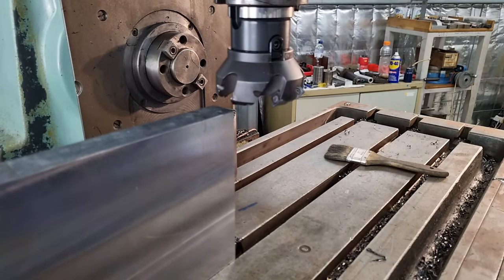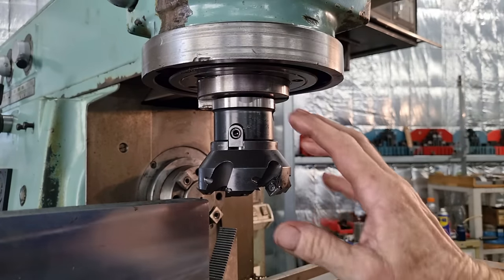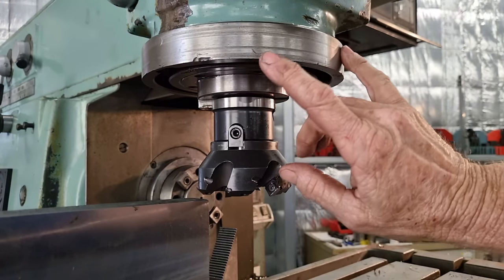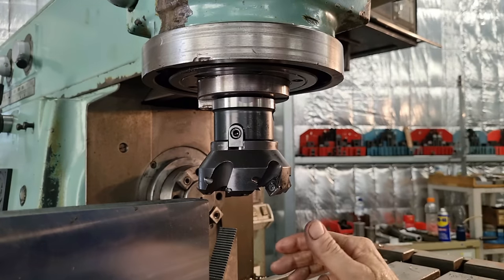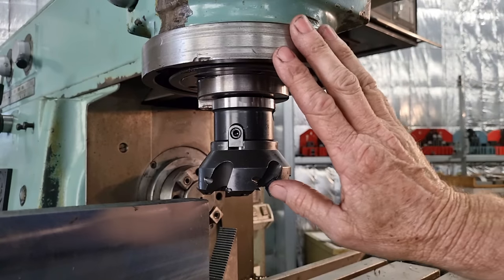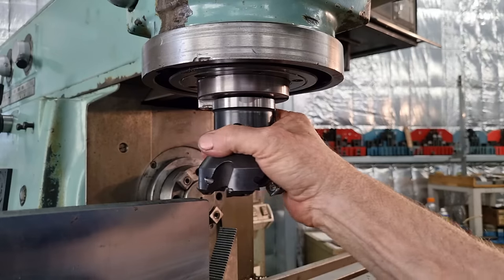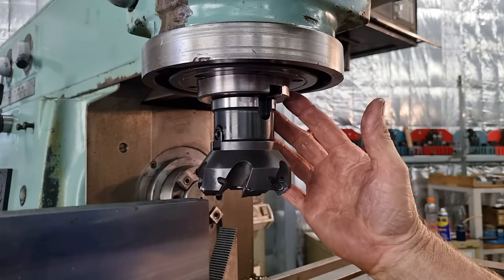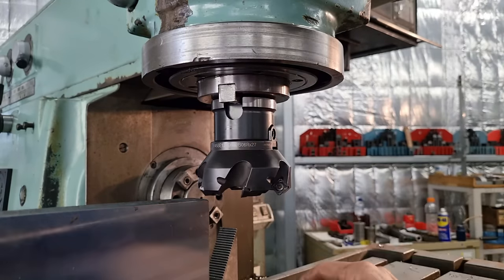Let me just pull up there. There's a couple of excess blobs of grease coming out of the spindle. Okay, I just had to wipe down a bit of excess grease from Olga's spindle here due to the fact that this had a large amount of dry grease in. I did throw a bit of extra lubricant in it, and that's all mixing with the dried stuff in it, slowly coming out. I do need to pull this vertical head off, strip it down and go through it. But anyway, yeah, she's a bit of a squirter in the morning with the vertical spindle when you first fire it up, and then she settles down a bit and will just seep a little bit of grease out for the remainder of the day.